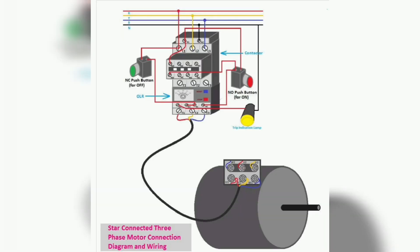Next we learn about 3-phase motor wiring in star connection. Here you can see the wiring of a 3-phase motor in the star connection. Connection and Wiring Procedure: 1. Find out the terminals of each winding of the motor. 2. Connect any one terminal of each winding together — here U2, V2, W2 are connected together. 3. Connect the R-phase of the power supply to the U1 terminal. 4. Connect the Y-phase of the power supply to the V1 terminal of the motor.